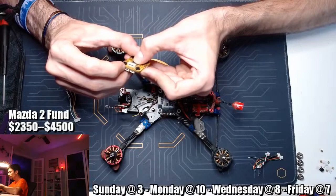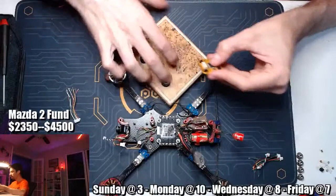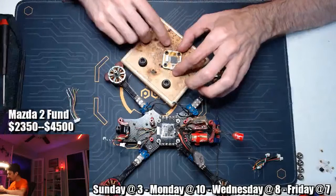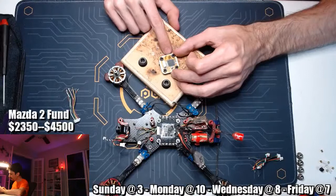The only pad here I'm going to use is the camera signal. So let's tin the pads that we are going to be using. We're going to tin this camera signal pad for one. And then they want you to hook the Crossfire up, according to their wiring diagram, over here on these through holes. So we've got ground, 5-volt, RX1, and TX1. So I'm going to go with their suggestion, and I'm going to use these pads.